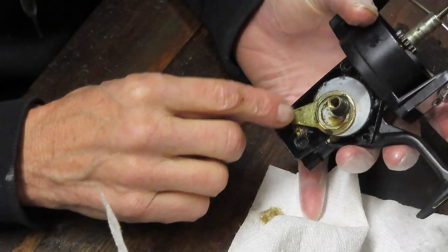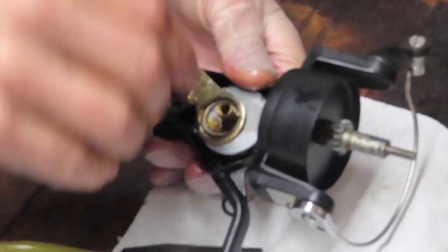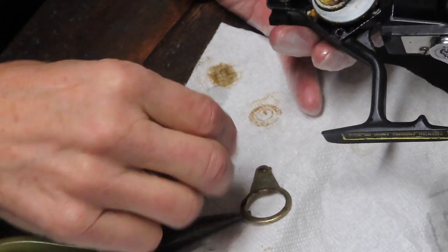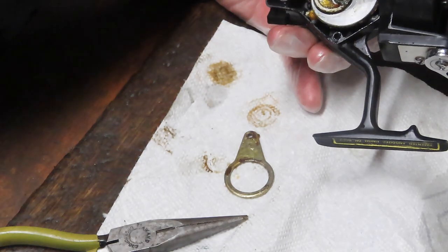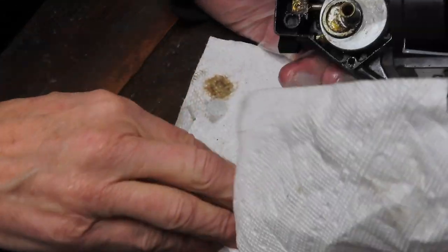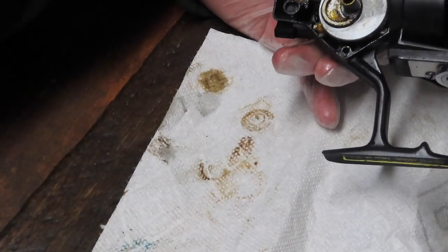Next up then, we're going to pull the pin for the crosswind arm, and with a little effort you should be able to get that arm off. So there's a little shim washer that goes on top of that arm. I'm going to put all my pieces and parts into a parts tray. This one is the bottom of a fast food container. And wipe down as much of the old greases and that I can off those parts. Make sure that they get nice and clean.